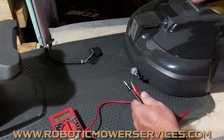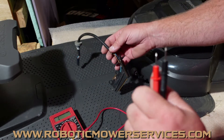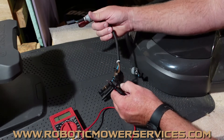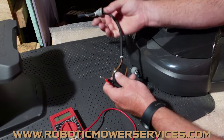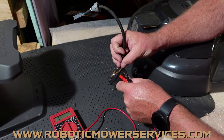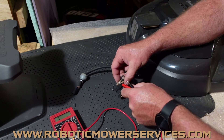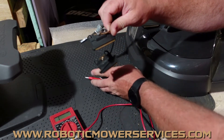I'll move this out of the way and show you. On this one here, if you did have high resistance when testing, you would take this thing out of the nose of the mower, take it out of the body, and then you would test it individually. You would go to your plug and come up to the end of the wire — this connector crimped onto the wire — and see what your resistance is there. And then you would go to the screw right here that connects the charging contacts.